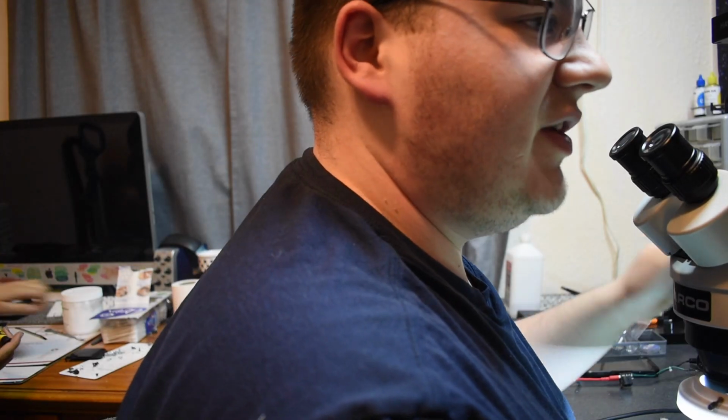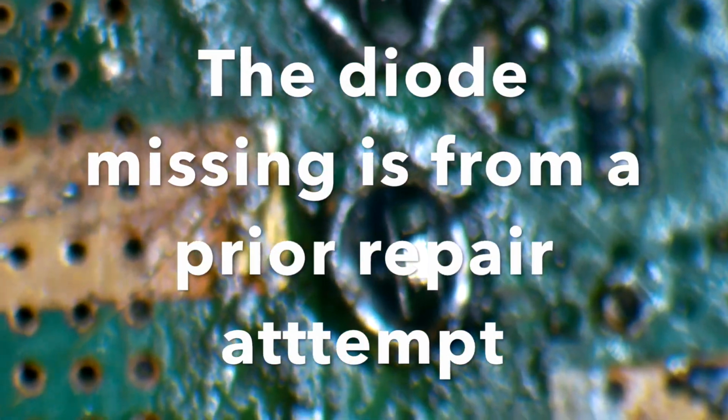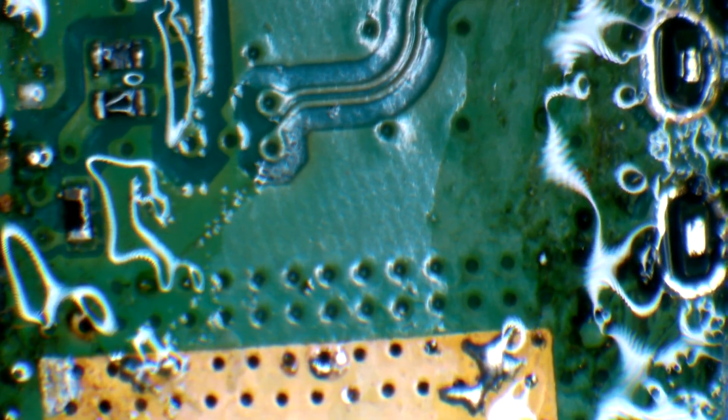I'm going to go ahead and solder up these anchors. Now they are not in good shape at all, but we will do our best. First thing I'm going to do is put some alcohol down, and we're going to clean up this area of the board. That's about as good as I'm going to get it, because it's pretty bad. Alright, we'll go ahead and put some flux down, and we will solder up these.